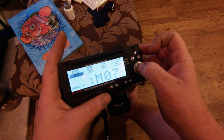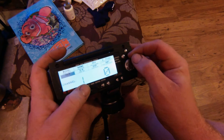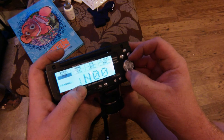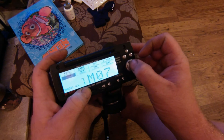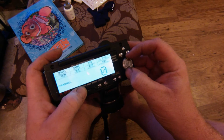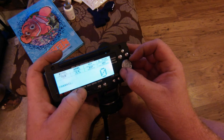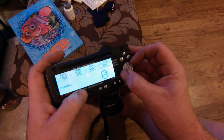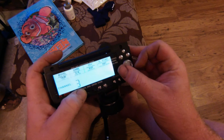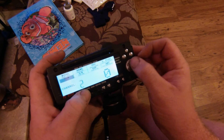I've also found since setting Luke's up that if you go into where it says trim and hold the switch down, it gives you a sub-trim. Not only do you have your normal trim which only covers channels one and two — if you hold the switch down instead, you can then trim all three channels. So you can get everything running absolutely perfect with no sort of lag between the ESCs — you can literally trim them to whatever you need, on channel three and also on channel two.